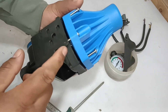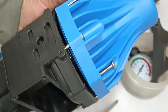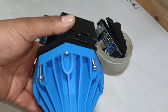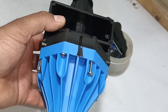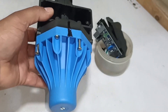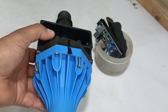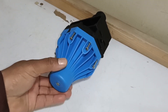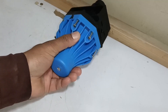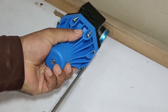After loosening these screws, this part of the controller has started to come up. I can see a spring is installed inside it. Before opening it completely, I have marked it. This marking has the advantage that when we assemble it back, this part will sit back in the same position as fitted by the company. Before opening the last two screws, I will prop the controller against the wall so that when I open these two screws, the spring doesn't push too much outward.